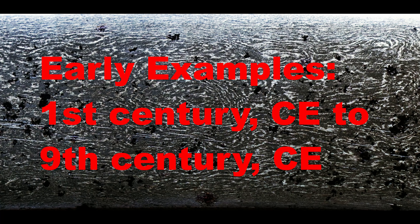The earliest known swords made from crucible steel date from the first century Common Era in Luristan. These were identified by the presence of spheroidized cementite in their microstructure. Metallurgical analysis indicates that they would not have formed a watered pattern if they were etched. The next archaeological evidence we have of crucible steel swords shows up in the 3rd to 4th century Common Era in the Russian North Caucasus. These exhibit similar signs and would not have been pattern forming. Moving along in history, there's a 7th century Sassanid, or Persian, sword made of crucible steel. It's a straight double-edged sword with a so-called pistol grip in the classic style of the time.